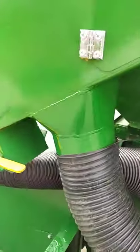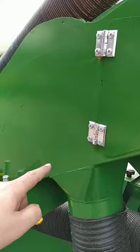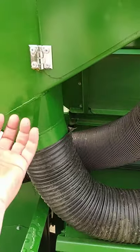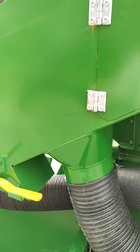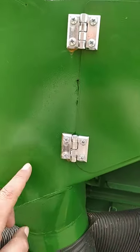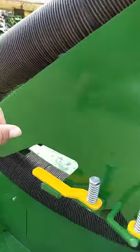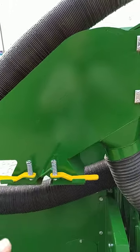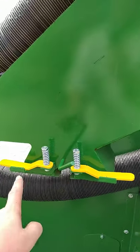The nuts come here and start dropping down. With the air that you blow through this hole, while the nuts are dropping down, you are trying to select the light ones and push them to the upper dropping section, which goes to the last sack. The point is to separate the light, empty ones to the last sack and the full ones to the other two sacks.